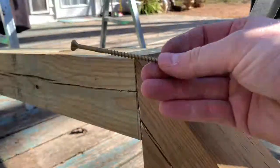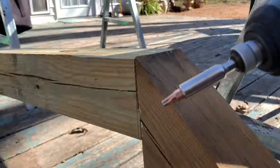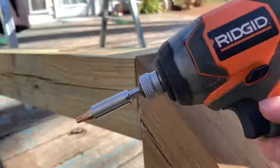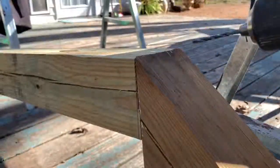When I set this thing down on the ground and let the base support it, it pinched together really tight. So now I'll pre-drill here and put a couple of screws through to hold the top together really tight. We're going to use the three-inch or three-and-a-half-inch screws — also star tips. We've changed that out on the impact driver. The impact driver gives it a little more force going through something this deep. We've also switched to a slightly bigger drill bit to pre-drill the holes.